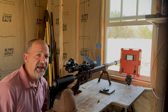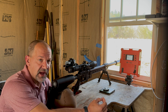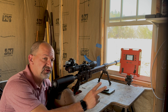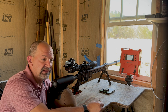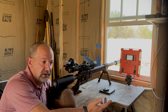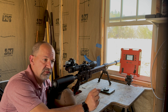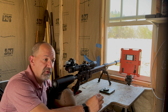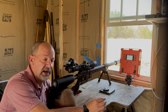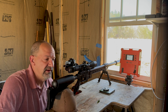I have found something out after doing a little tuning and a bunch of shooting. The tungsten hammerweight is twice as heavy as the stock, and that's critically important. If you had a tune with the stock hammerweight, just look at your settings on your macro and micro — look at the gauge, one, two, three, and four. If it were a four with the standard factory hammerweight, drop it back to a two and you're going to be real close to your tune.